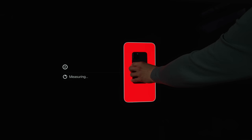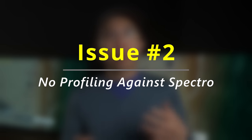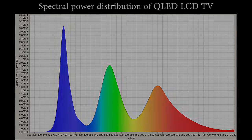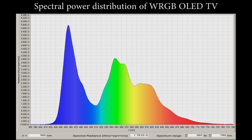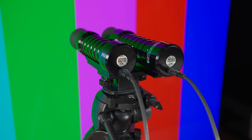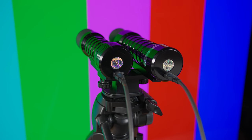The different results between OLED and LED LCD display technologies highlighted another fundamental shortcoming: the lack of profiling for different display technologies. There are several types of televisions — LED LCDs with traditional or PFS Phosphor backlight, QLED TVs with quantum dot enhancement film, WRGB OLED televisions, and even certain 2021 OLEDs with a new green emitting layer. All these technologies have different spectral power distribution, or SPD, so to obtain accurate luminance and colour measurements, a colourimeter needs to be profiled against a spectral radiometer. Here I am using a Colorimetry Research CR100 tristimulus colourimeter profiled to a CR250 narrowband spectral radiometer — the minimum level of equipment required of a professional calibrator worth hiring.